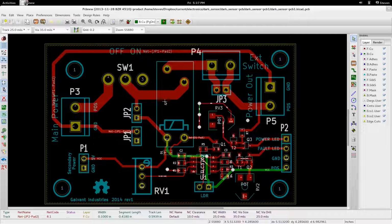Another example of that would be the microcurrent by Mr. Dave Jones of the EEVblog, right? He does the same sort of thing. He's got all the connectors, user interface stuff on one side of the PCB, and on the opposite side, all of the components that you don't want to be touching, all of the passives and the op amps and whatnot, which then get located within the housing.